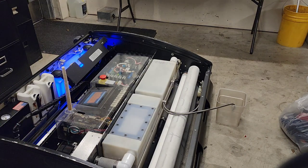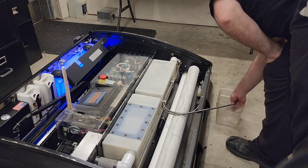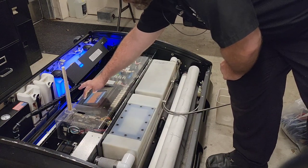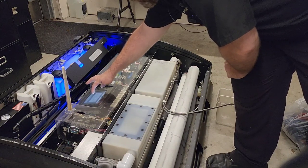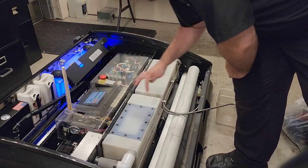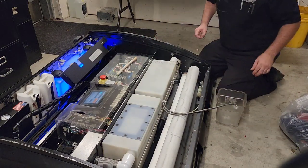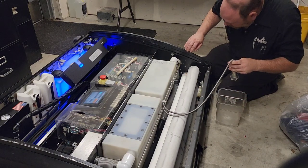We're going to look for the dispensing tip over here to stop spitting out air bubbles. And it has. So pump off. Now we're going to go to the cleaner concentrate or test oil cleaner pump volume. Cleaner pump calibration and adjustment. Enable test. Water test. Book spec is 25 milliliters of water at a 5-to-1 dilution ratio, which is what we're using. So we're going to hit our start button.